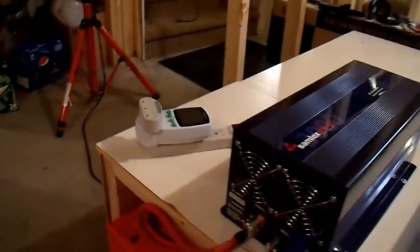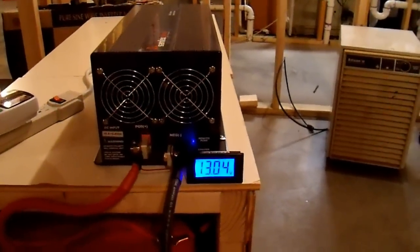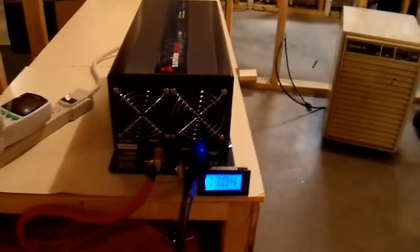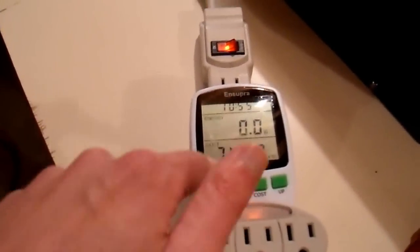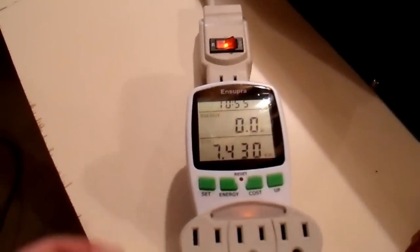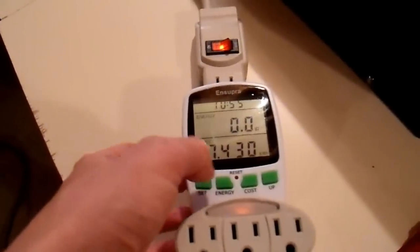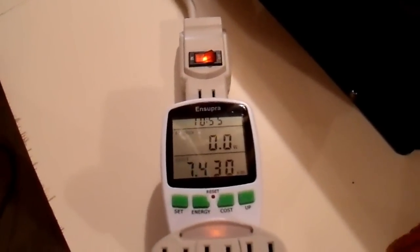The inverter is on. This inverter takes about 2 amps under no load, and you can see that the voltage is slowly falling. In the inverter I have a power strip connected up — once I turn it on, the power meter will boot up. This happened to show how long the power was out — it took 7.4 kilowatt hours. In any case, let's select — zero watts. Perfect. I'm just going to leave that on watts.